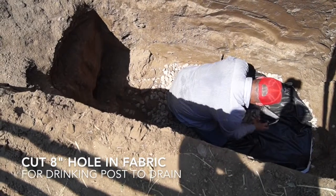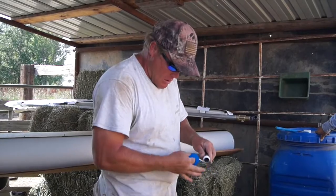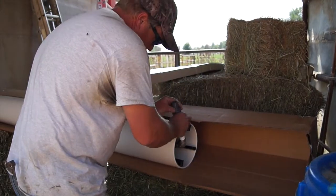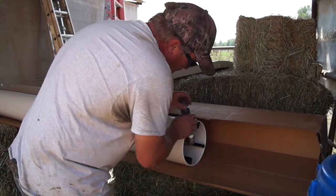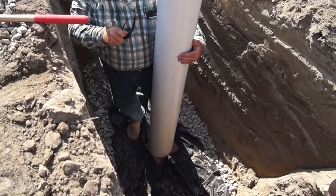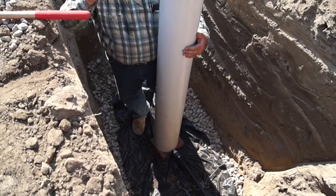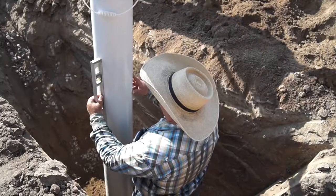We're going to tie into our water line and screw that water line right into the post. We're going to take a bucket or shovel and backfill real gently around that connection down at the bottom. Then just gradually fill in the hole, keeping everything as straight up and down and as perfectly vertical and level as we can.